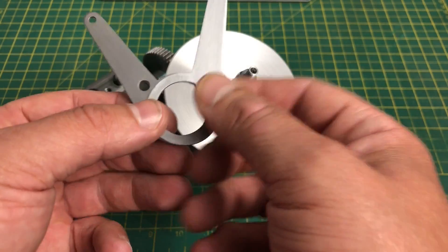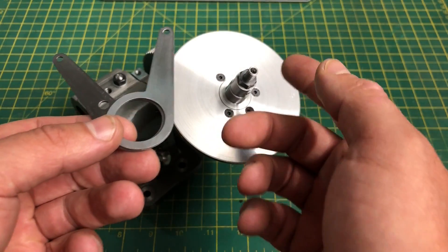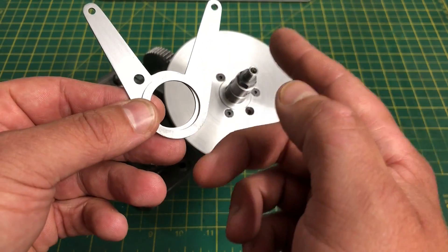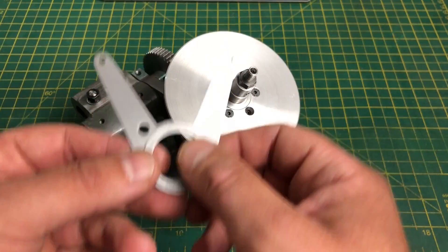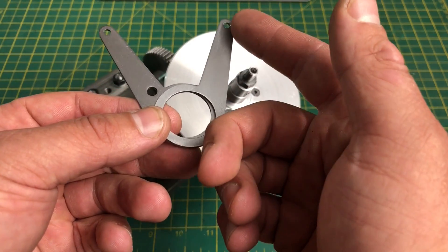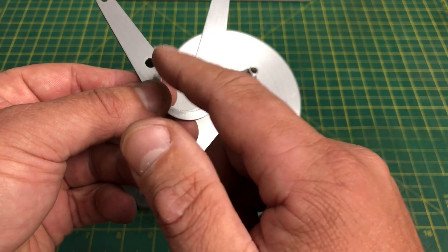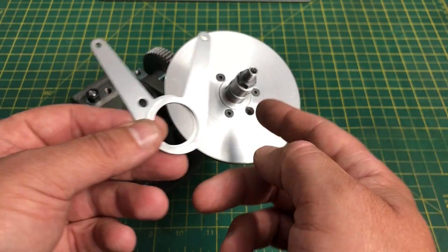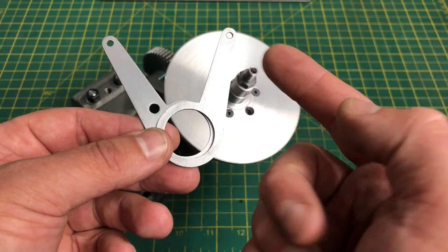In this part I'm going to finish the sector arms. They need a retaining nut to thread on here that will have a register to take the fingers themselves, and a spring to hold them against accidental rotation. Additionally they both need a ball knob for the ends, and they also need a clamp to hold them at the chosen spacing. I'm going to start with the nut and the spring, so let's move over to the lathe and make a start.